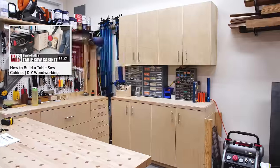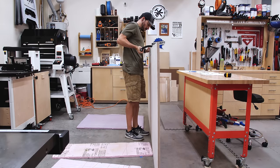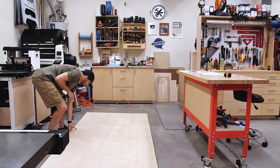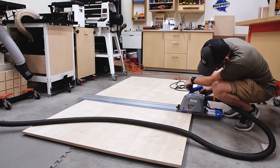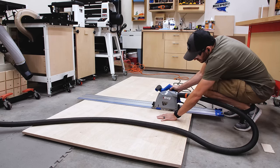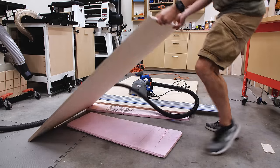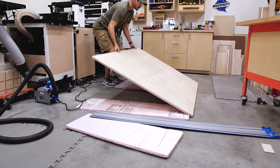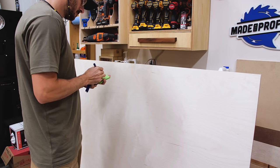You may have seen me make a few cabinets on my channel, but today I'm really going to lean in on the tips and tricks to make cabinet building go smoothly. I'm using three-quarter inch Baltic Birch plywood. I think cutting it on the floor using rigid foam is the best approach for me — on the floor you can crawl on top of the sheets, which makes reaching across the panel a lot easier. I use sticky notes to label everything.